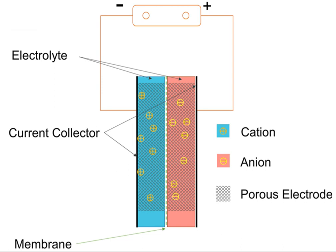Asymmetric supercapacitors are inherently polar. Pseudocapacitor and hybrid supercapacitors which have electrochemical charge properties may not be operated with reverse polarity, precluding their use in AC operation. However, this limitation does not apply to EDLC supercapacitors. A bar in the insulating sleeve identifies the negative terminal in a polarized component.